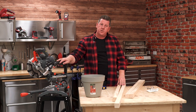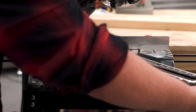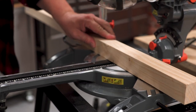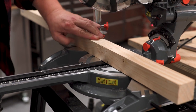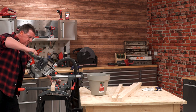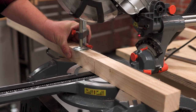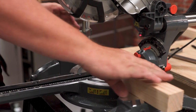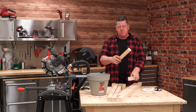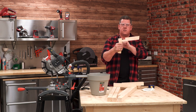We just need to move that timber onto our mitre saw and we're going to do some trench cutting. Let's go ahead and get the sliding mitre saw all set up. We just want to move this to 90 degree cross-cut mode, bring it around to zero on the gauge, and lock it off. Grab our first piece of timber for the base, turn our laser on and line up our laser with our pencil mark, lock the material clamp down, and we're ready to get cutting. That's the first piece of timber for our base. We're just going to repeat that one more time. We now have our two pieces of the base and we want it to be in a criss-cross pattern like that.